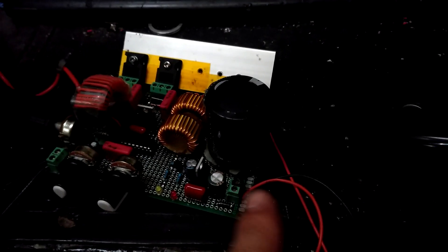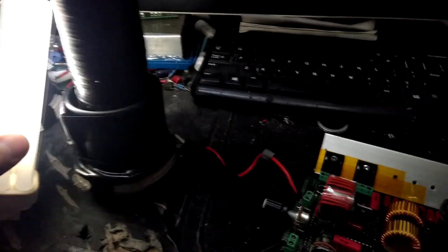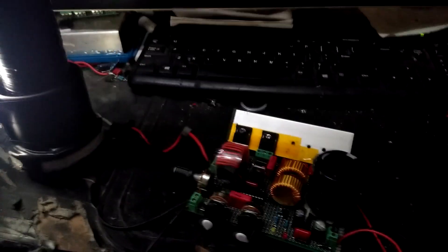That's pretty cool. I was sitting here thinking I need to add a separate logic supply to be able to run it down to a fault, because I know it will run down to a fault and I can get really good output. But I might not even need to, because apparently you can just run this whole thing off the single rail and bring it all the way down to under three volts — so long as you kick-start it first.